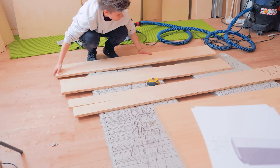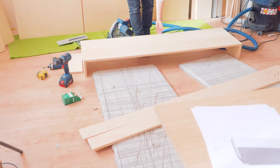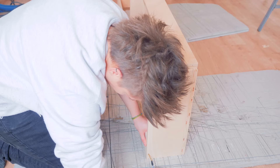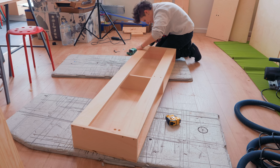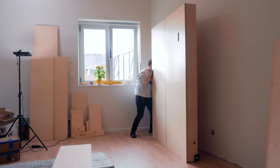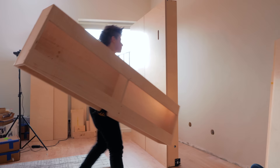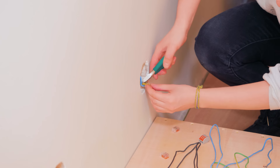Now comes an important part. Because I want the bed to flip over the sofa cushions, it needs to be raised a certain amount in order to fit — this is why I discarded the provided metal legs that came with the Murphy bed kit. In my case, I needed to make a small platform for the bed to sit over. When the bed is lowered, it will sit over the sofa and over the upcoming coffee table, so I don't need extra legs and they wouldn't be the correct size anyway. So if you're just building a regular Murphy bed, ignore this step and attach the metal legs.